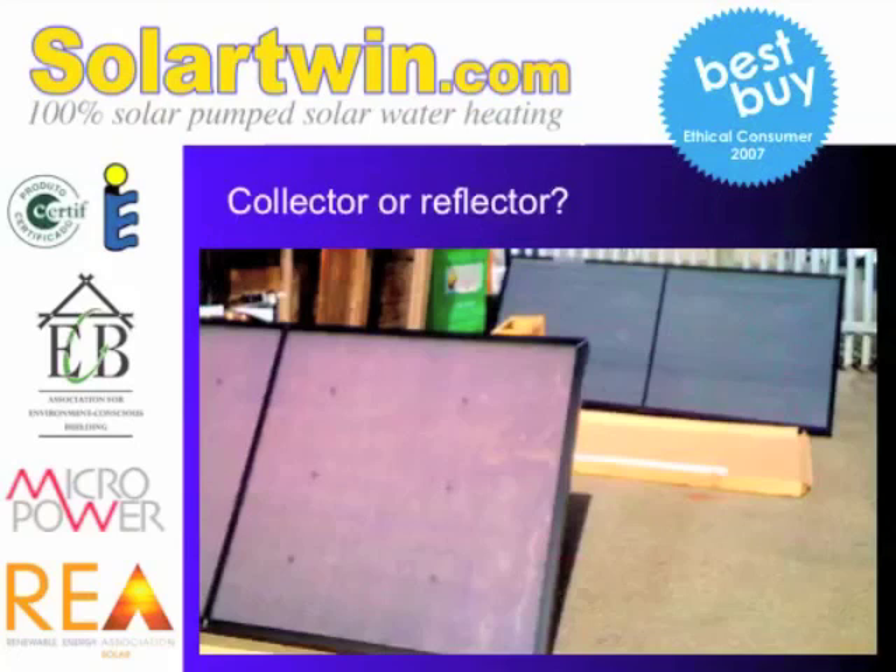Currently there's a big problem in the solar heating industry: you can't put maybe three or four square metres or more of solar collectors on a normal UK-sized 120-litre hot water store without the thing boiling somewhere somehow in the summer. What we're trying to create is a thermal step-change solar collector. Once it gets above the temperature of usefulness — over about 70 or 80 Celsius — it shuts down. We've got a paint on this solar collector which is black when cool, but by the time it reaches 80 or 90 degrees Celsius, it's white. White things reflect heat; black ones absorb it. So what we've got is a solar collector that collects when it's cool and reflects when it's too hot. You can put loads of solar collectors on an existing hot water store and not be worried about boiling and all the safety issues that go with that.